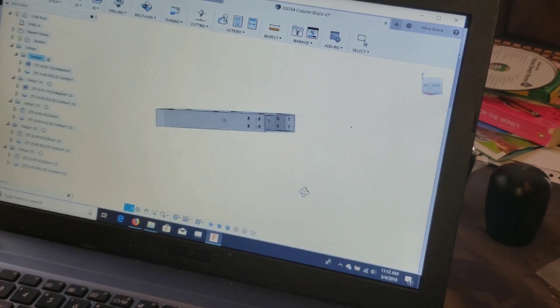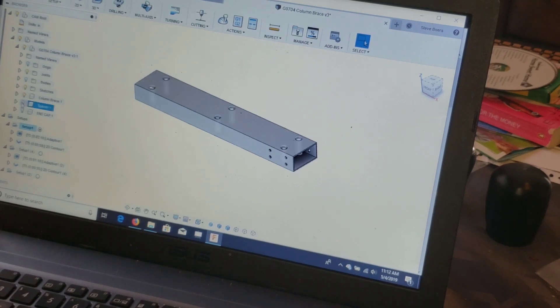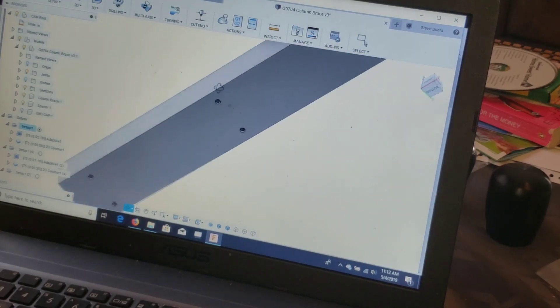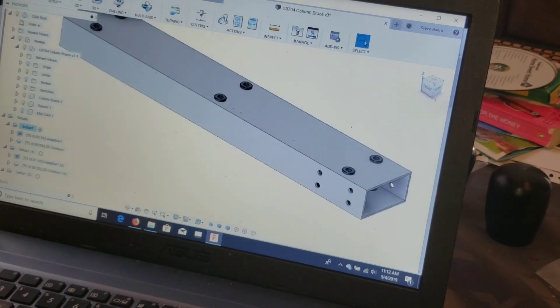Just to give a quick illustration — here we go. The spacers are modeled up in there. You'll see they expose themselves a little on the top but won't go all the way through. That way there's a solid aluminum spacer transferring the torque of the bolt all the way through, putting really good solid pressure up against the face that will be up against the column.